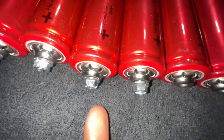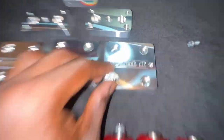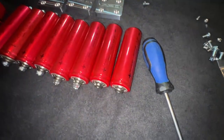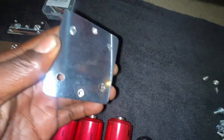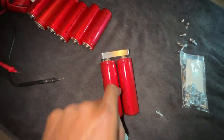Quick note: if you go on Battery Hookup and get some of these cells, they may come with some screws or bolts already in them. That's fine, but if you get some Project DB bus bars, those screws are not gonna work — you're gonna have to use the bolts that come with the Project DB kit. That's because those bolts fit straight down into the groove. If you try to use the ones that came already on the cells, they're not gonna fit in that groove with these bus bars.